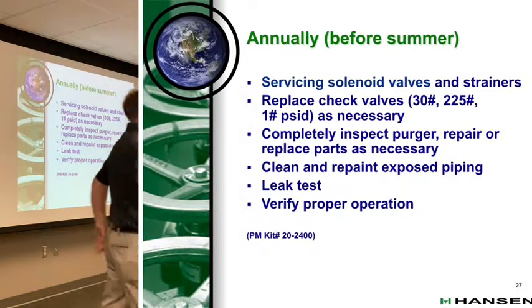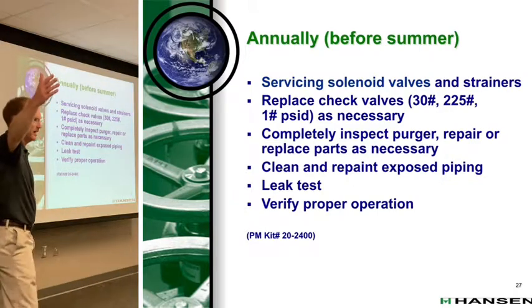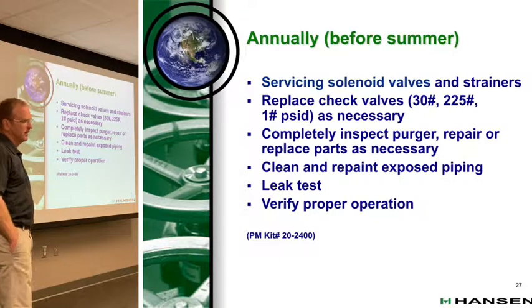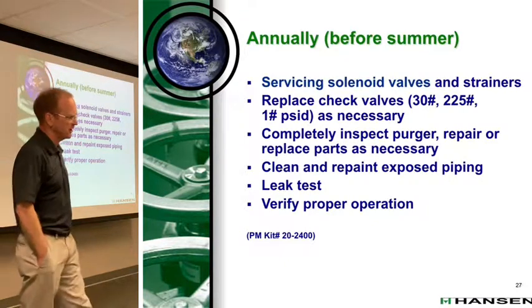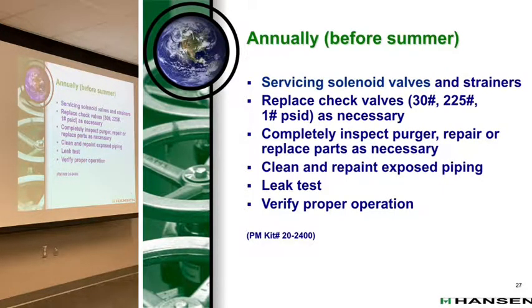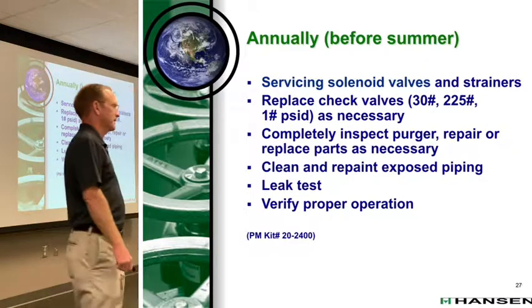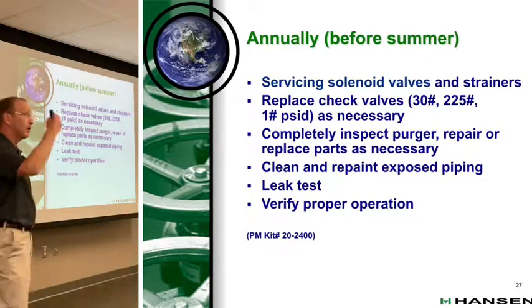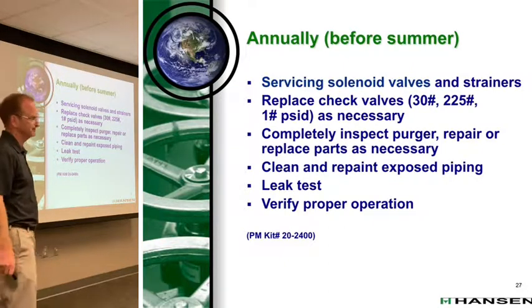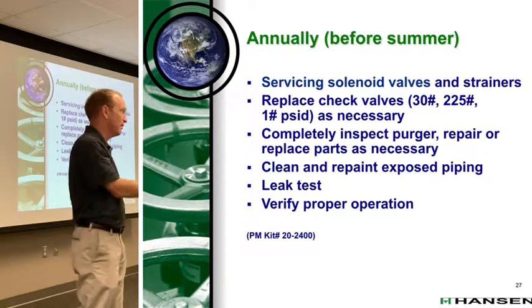But you don't take it off the high pressure receiver, remember? You have to take it off the lowest, ideally the lowest temperature vessel. Taking them off our circulator. Yeah, off the pump. The pump discharge is not a bad place to do it, kind of a lower state. Because we're getting it out of the oil pumps. You're getting water on the oil pumps, but that's not where you do your test. You do your test on the pump discharge. That's how you know.